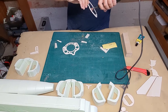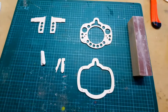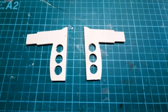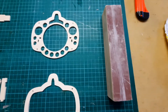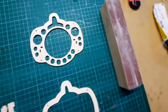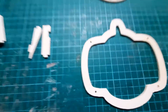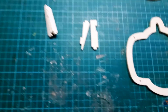Let's get started. All wood parts are cleaned — you see that there is no excess wood around the spars anymore. As tools we use a straight sanding block; in my case it's a maple block with some sandpaper on it. I also used the Dremel before to clean the inside of the spars where the excess wood was.